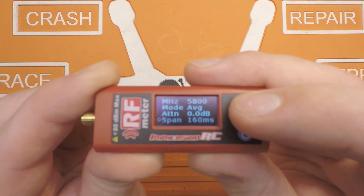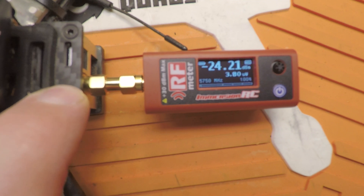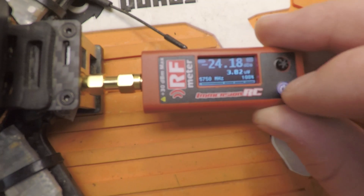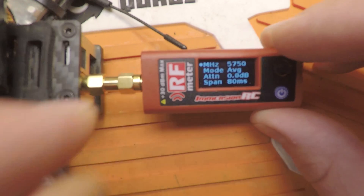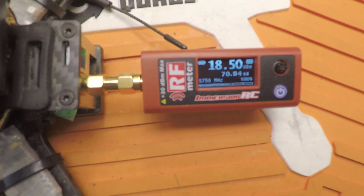The span setting is just your sampling time. Now let's see it in action. I've got it hooked up to a TBS Unify HV, and I'm going to be on Fatshark 1, so the frequency is 5740. I'll pick the closest frequency range on this, which is 5750, because it's only calibrated in 50 MHz steps. Currently my power output for the VTX is set at 200 mW. As you can see, it's outputting 131 mW, and it's putting out 21 dB. When you're using something like this, you want to start thinking outside of the box of milliwatts and start thinking about dB.